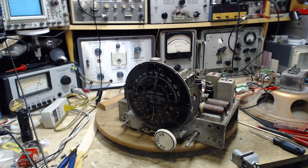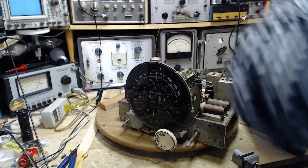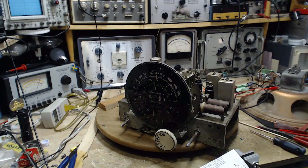Usually the first, and I have to read the instructions, which I did not pop up on the screen this time. Let me just look at them on my own. What does it say? Adjust to 5. Okay, so I've done it to 3 instead. It's not the best thing to do. Calibrate the dial, adjust trimmer number 9 for maximum output. Trimmer number 9. Where will I find you? Oh yeah, it's this one.